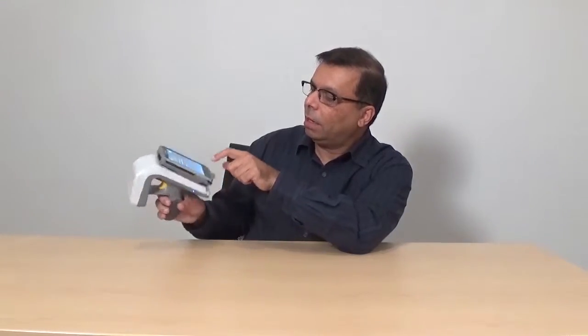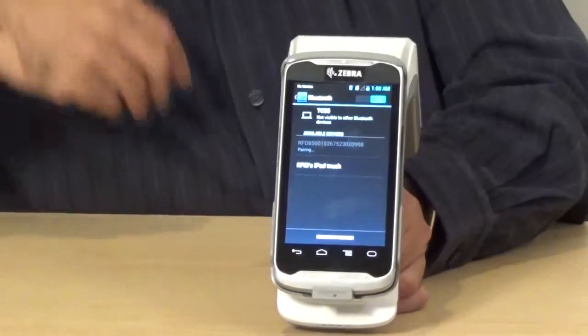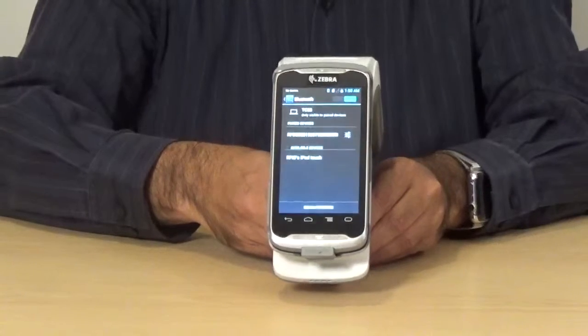As you will see, once you select the particular device here, it shows the status on the Bluetooth LED — it starts blinking faster. Once it is blinking fast, pull the yellow trigger to pair the device. As you will see now, in the paired device status, you will see the particular ID or serial number of this reader, which is shown at the bottom label — the full serial number with the last two digits, 98, showing up in the list of paired devices.